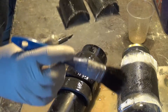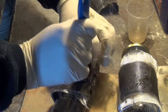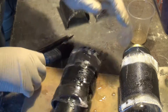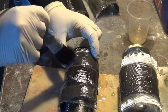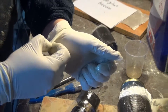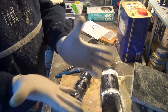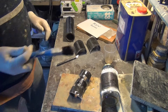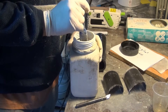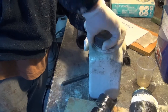The 80g fiberglass roving was applied to the smaller pieces using the same procedure. Using two pairs of gloves allows us to remove the outer pair and immediately have a second pair underneath. The paintbrush used to apply the resin was dipped in a jar with acetone and will stay there for 24 hours — this jar has to be tightly closed, as the acetone will dissolve the resin and allows us to reuse the brush.